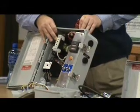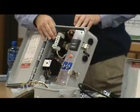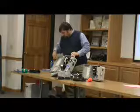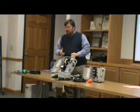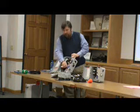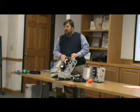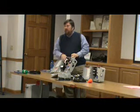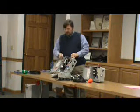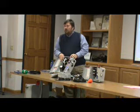I work a lot of times with the people that call in and I help troubleshoot the panels. And most of the panels with the logic, if you understand the diagram and you can read the diagram, I can walk through and without a voltage meter tell you where things are not working. Because if I come out and the pump isn't working, I flip it into hand. If the pump pulls in, I know that the fuse is good and stuff like that, then I've probably got a problem with the float switch or somewhere else in the circuit. So most of the panels, if you use a little bit of common sense, you can flip a switch or something to eliminate where you think the problem is.